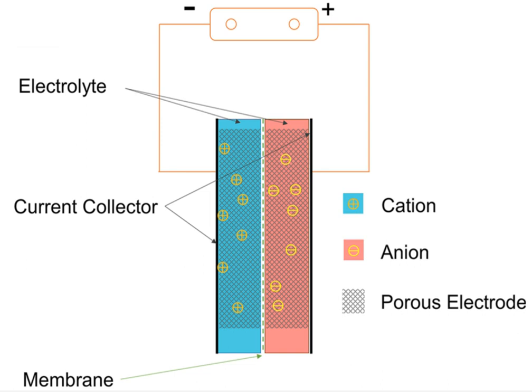Electrochemical pseudocapacitance. Applying a voltage at the electrochemical capacitor terminals moves electrolyte ions to the opposite polarized electrode and forms a double layer in which a single layer of solvent molecules acts as separator. Pseudocapacitance can originate when specifically adsorbed ions out of the electrolyte pervade the double layer. This pseudocapacitance stores electrical energy by means of reversible Faradaic redox reactions on the surface of suitable electrodes in an electrochemical capacitor with an electric double layer.